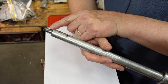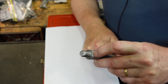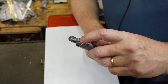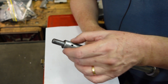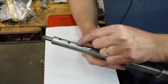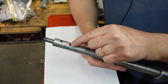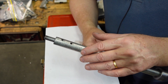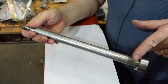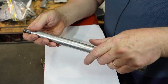This end here is just a half inch Whitworth bolt, and inside there's a sleeve between the diameter of the shank of the bolt and the inside bore of the pipe. I cleaned that up — there was a fin in there — I cleaned it up with a drill bit and then pushed a couple of roll pins in to lock it in place. That's going to go through the body of the dividing head, and then I'll have a loop on each end joining at the top with a lifting loop.